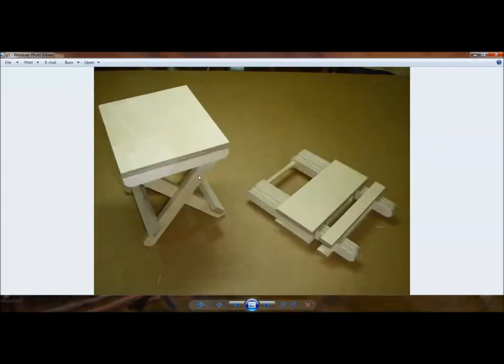Here's an example file — a little folding stool. The tolerances on this are so tight that with 0.69 material the file works just fine. However, if we had another piece of plywood somewhere in a different part of the country or world and another customer downloads this file, their material is going to measure differently. So how do we get around that to get the pieces to join together?